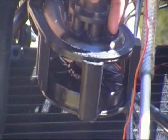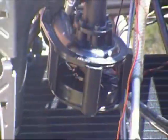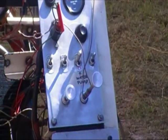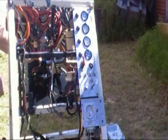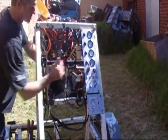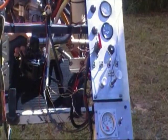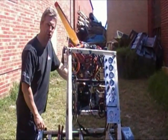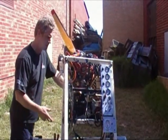As you can see, we've got an electric water pump — it's 80 litres per minute, more than up to the task. We have a switch that turns the pump on, and in the aircraft we'll use a thermostat that brings the pump on and off to regulate the water temperature. The pilot will have an override switch just in case the thermostat fails and can turn the electric pump on manually. One advantage of the electric pump is that after shutdown, when heat tends to soak and elevate, we can keep the pump on to keep the coolant circulating so the engine continues to cool even after shutdown.